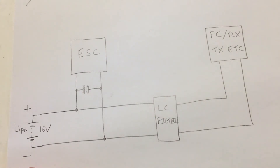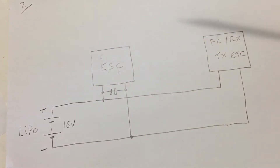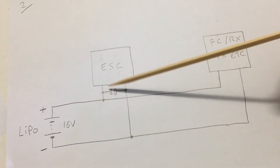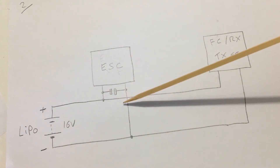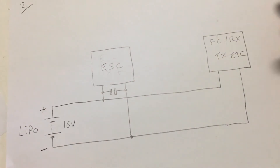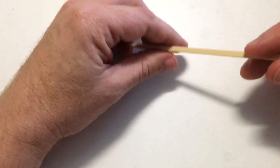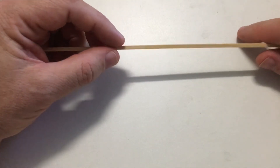That's the approach I take, which is quite sophisticated — we've got more components involved. I think the minimum that most people would do would be the first option, which is just to have a capacitor. You can have one large capacitor against the supply within the PDB itself, or you could strap a capacitor to each ESC — and I think that's the most sensible option. It's not much weight, very small, and they seem to do a very good job. I hope you've learned something from these videos. If you'd like to give me a thumbs up that will help me greatly, and if you're interested in seeing more topics like this then please let me know. Until next time, thanks for watching. Let's go fly!